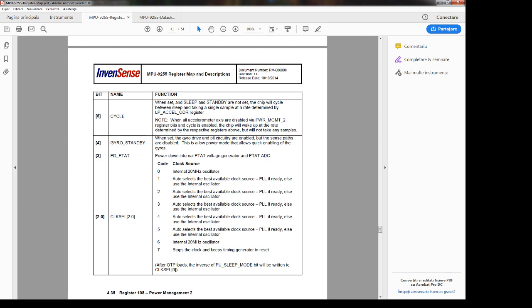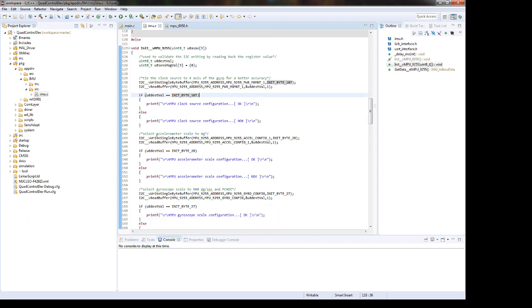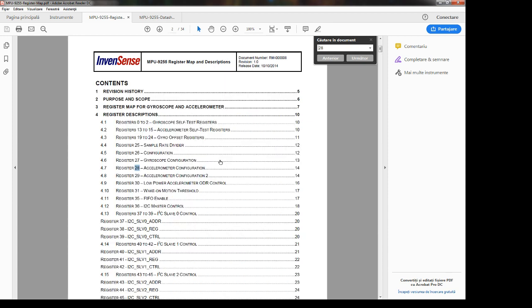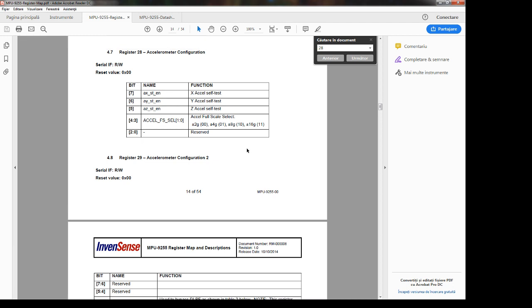Then the next step would be we will select the accelerometer scale to 4G. Yeah, this is done with the register 28 and with this configuration. So we will see 28 accelerometer configurations. Yeah, and we will choose the scale like this, 4G. Okay, I will provide the code in the description, so you can check by yourself.